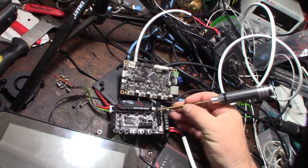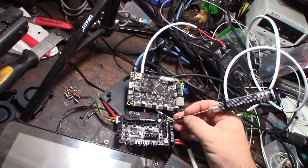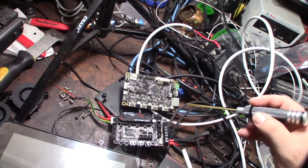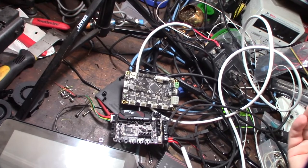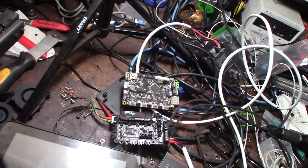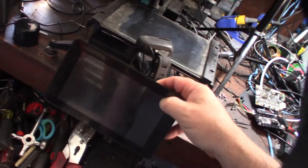I'm going to test with my multimeter - I want to see if actually hooking up the proximity sensor changes the voltage at the voltage pin. Normally this would be 5 volts because it's powering a BL Touch, but if I put a jumper on there, does it connect to the higher voltage bus? We're going to find out. Plus I'm going to be running a 7-inch touchscreen, so I'm taking the original screen off.